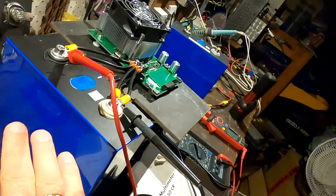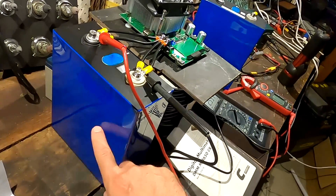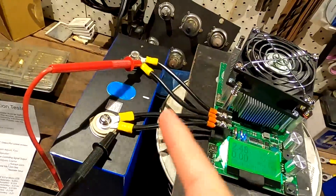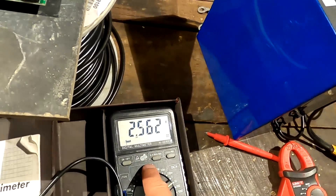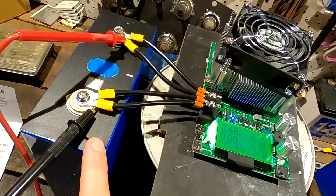Reading the specifications again: if you charge to 100% and do a capacity test, you should wait one hour after fully charging the battery. This allows the chemical reaction to finalize and the cell to equalize internally — high-volume cells need that time. I only waited about 15 minutes, which could give you another couple of ampere hours. Also: don't leave the battery like this. It's at 2.5V now and needs immediate recharge to at least 3.1–3.2V. Bring it above 25–30% before leaving it. Never leave a battery fully empty or fully charged for too long.